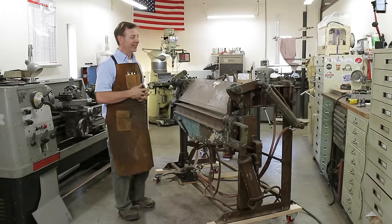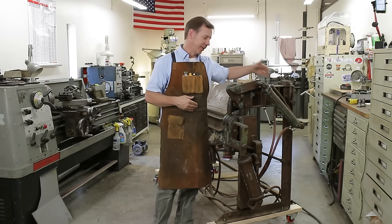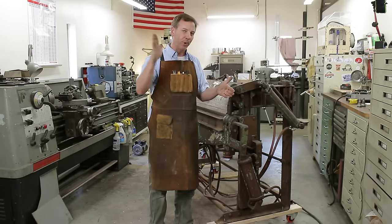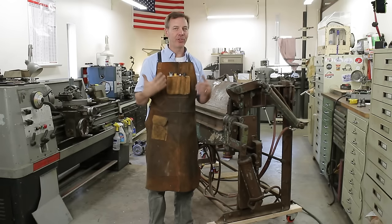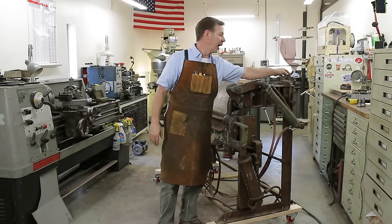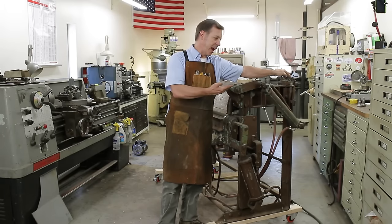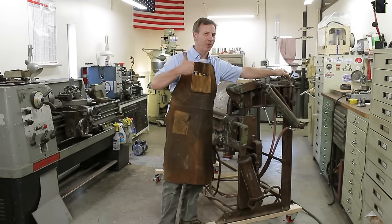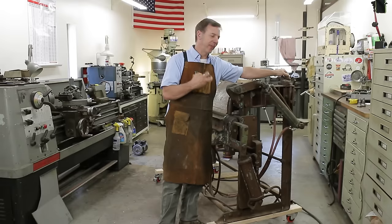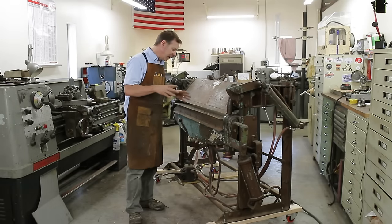Some of the other interesting things on the pneumatics is the cylinders are driven in both directions, and that's because of the hydraulics or the pneumatics levers. So it pushes in and pushes back, and that gives you control to make it move in and out softer. I've got volume valves here, I'll call them, because I can control the volume of air. So I can have the pressure way up, but I can have the air cylinders fill up slow, but still with that high pressure to make this a safer unit. And there's a lot of other things I want to do.